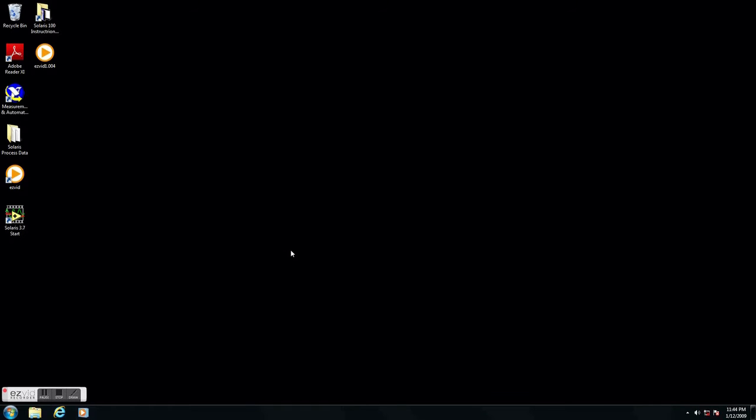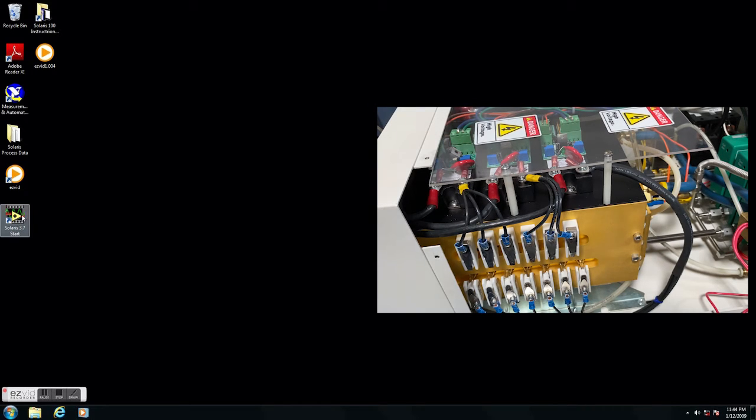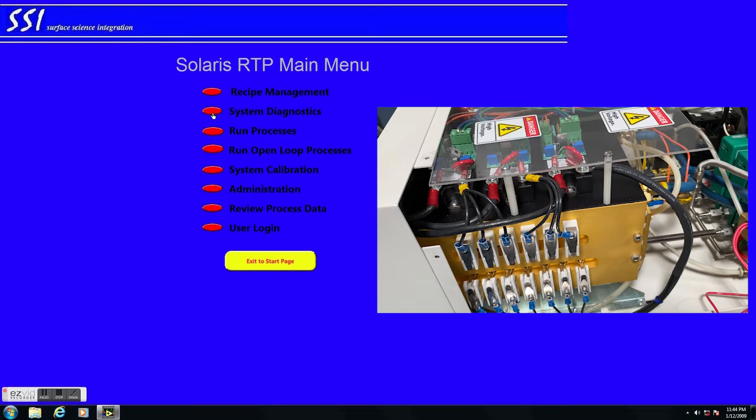We're going to be testing a tool out today, and the condition was that it had a lamp bank out. So if you have a lamp bank out, more than likely it's one of these cards that sit on top of the SCRs, or the SCR itself, that control the lamps. So these 3 circuit boards on top control each bank.